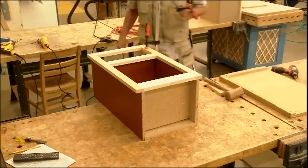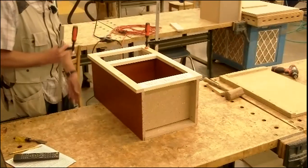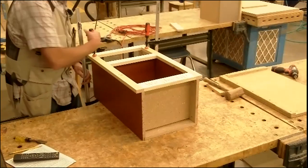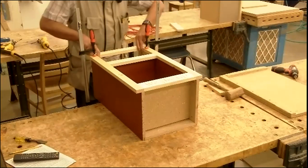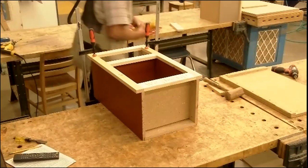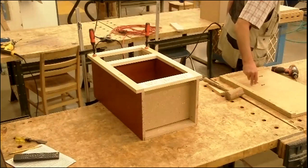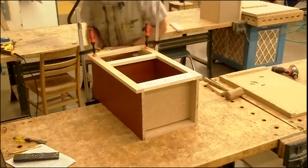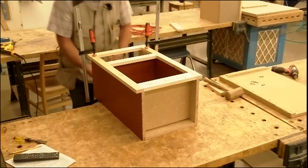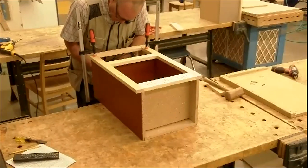We always have to have a clamp over where we're going to drive a pocket screw. Otherwise, it just pushes the material away from the cabinet. It doesn't do any good. Okay, I double check that it's where I want it, that I didn't move it. Okay, now we have our angle drill. Gotta get this guy out. Okay, same thing. I'm gonna put all my pressure under the head of it here. I'm just gonna set my screw on the tip of the bit and I'm gonna reach in here and I can find the pocket hole where it needs to go by feel.